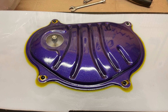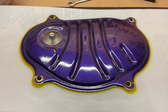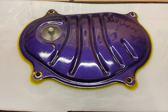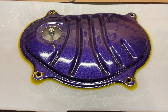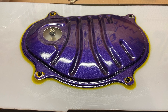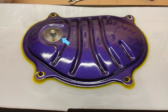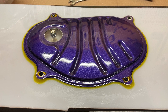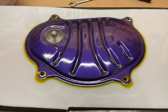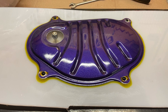Before starting with the carbon fiber part, we did a mold, and before making the mold we need to prep the part. The fuel pump cover has five or six layers of mold release wax buffed out to a really nice shine. After this I put it on a white sheet of plastic — this will help with making the tool so I can build up nice flanges for the next steps. I tried to attach it with hot glue but it didn't stick, so I drilled through and used small black bolts. I also closed the big hole where the wires and grommet come through so no resin gets underneath and inside the part. I did the same around the edges with yellow fillet and wax so no resin gets underneath and we get a nice release. It's also covered with a PVA release film.